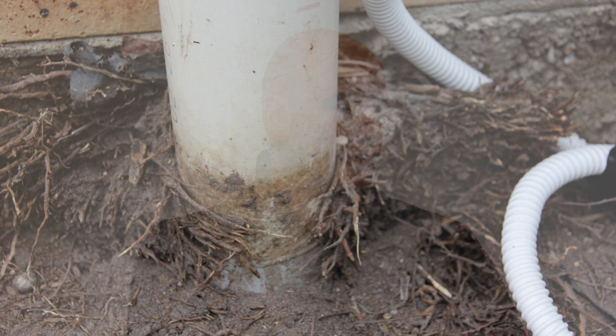Once we dug things out and pulled the garden beds back, you can see the concrete slab — and look at the roots that have gone up against it. They actually started making their way into the concrete slab. Do not have invasive root systems and big plants in garden beds up against your building. You can see the root systems that attacked — roots going all around the downpipe and up against the concrete slab below the brickwork. Moisture starts getting into your building envelope and can break down downpipes. Just a disaster.